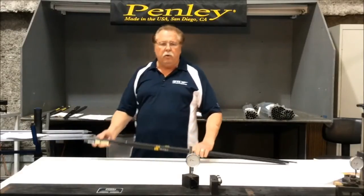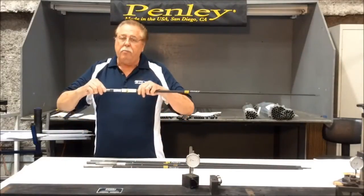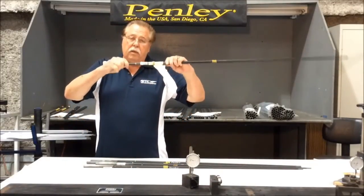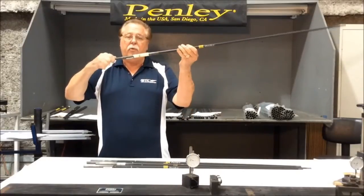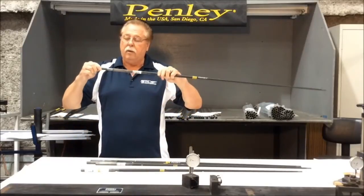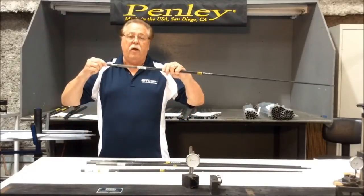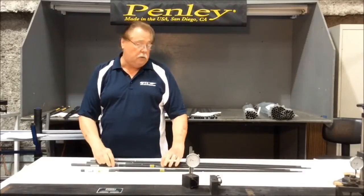I don't know if I went through this for you before, I don't think so, but on these guys here, we've got 530 butts. This is a 530 plug gauge. It fits right in, slides in there, and you can tell that's 530. It's got a nice snug fit. On the counterfeits, it won't even start. They're 520s, so they're already down. That's why, as I mentioned, the flex was way down and the stiffness.